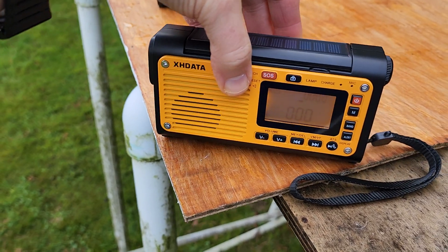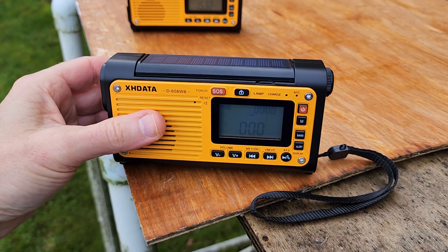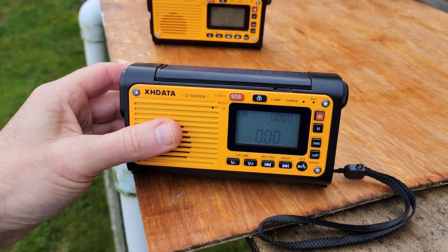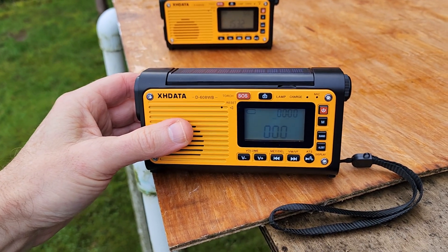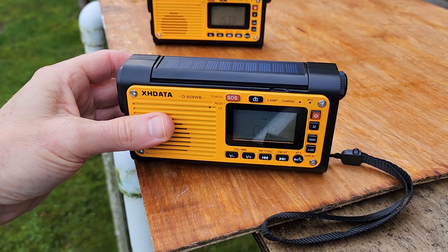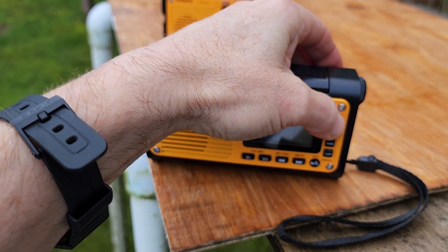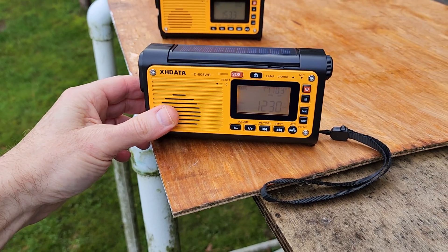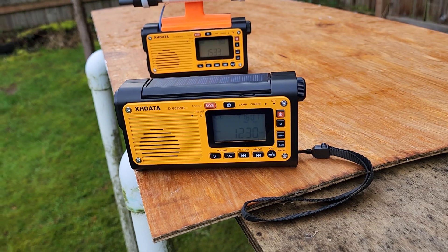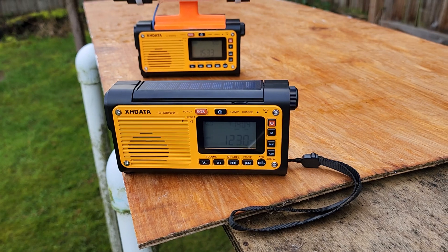So I gave you an unintended demonstration of the siren. The medium wave reception on the AM band is fairly good for this. It has a DSP chip, but there's no selection for any filters, so you're pretty much stuck in what I'm pretty sure is the 3 kHz setting. I do have a daytime DX fringe station selected — a Korean format station, 1230 KWYZ.